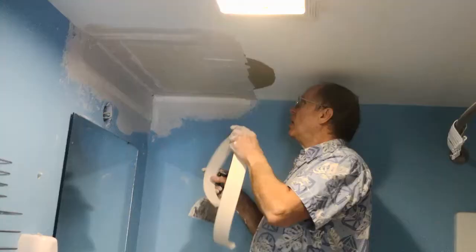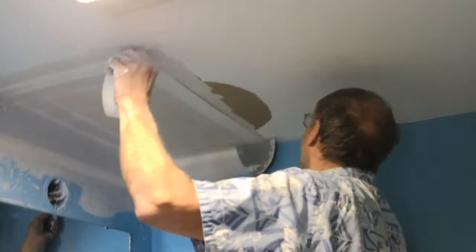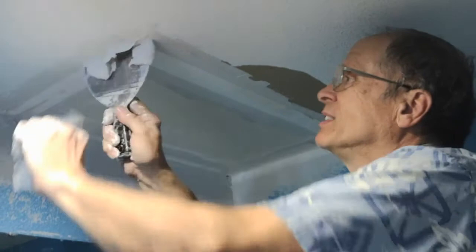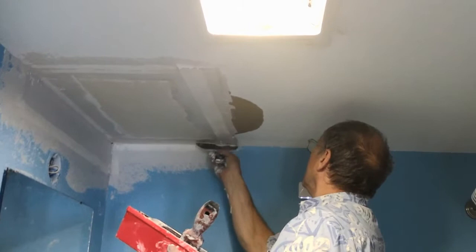I'm putting on the last piece of tape — we did have just enough mixture. It's a matter of getting the tape on there and then squeezing out the excess from underneath. I've only worked with a professional once on this and this is kind of the way he did it. I am not a professional, but I've done lots of taping and texturing. I do texture after the fact because I'm not doing it smooth enough to go without texture.